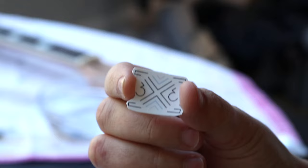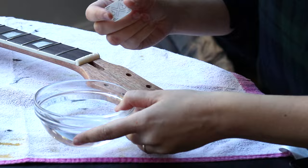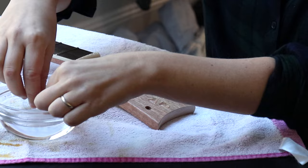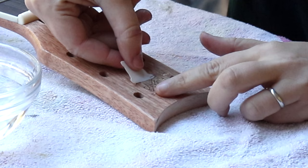Now the rest cannot be any simpler — just soak the decal in some warm water for about a minute and you'll be able to feel the decal slide off the paper backing. At that point it's ready to be applied. To apply it, dab a few drops of water onto your finished piece of wood, then just slowly slide the decal off the backing onto the wood. Adding the drops of water before applying makes the decal easy to move around and place exactly where you want it.